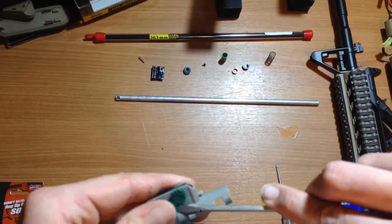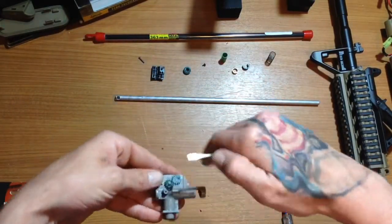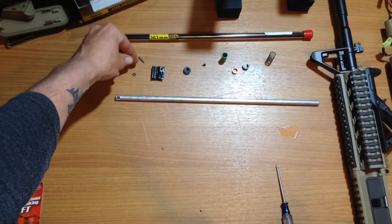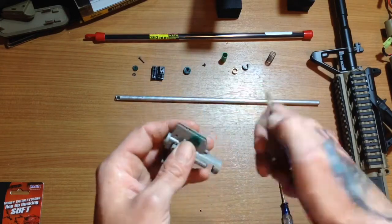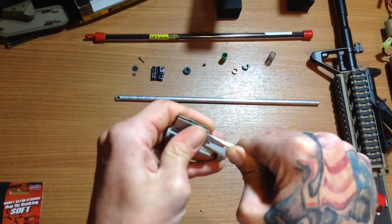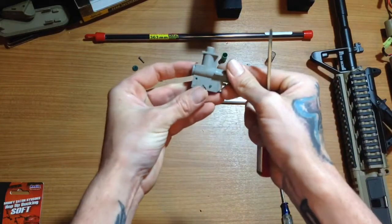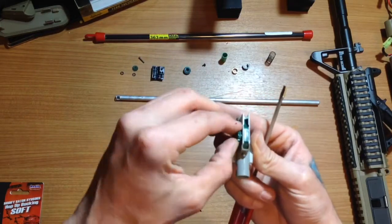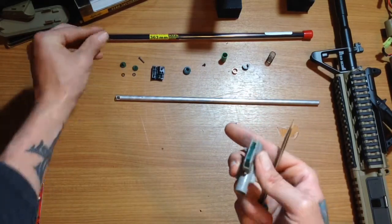With a very small screwdriver, very gently give some upward pressure — hold your thumb on top, give it a little up pressure — and that will take off this gear. See, now that's the gear retainer ring and gear. Now this gear retaining ring is on the opposite side, so let's put my finger on the back there. Get real careful up under there — don't want to damage anything. Come around to the back of the retaining ring. Now I'm going to push this piece and pull out my gear. All my gears look good still, and there is gear number three, in order.